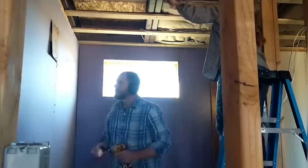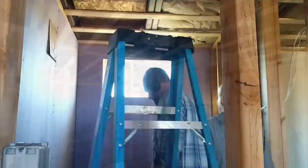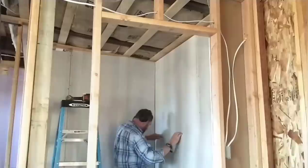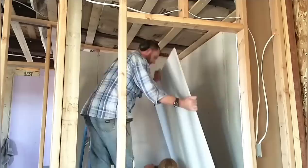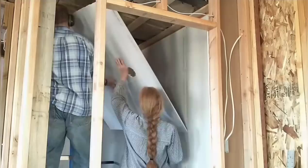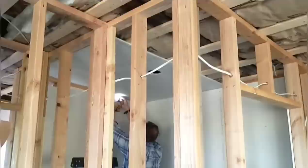While April works on insulation, I'm hanging drywall. The bathroom gets purple drywall — mold and mildew resistant, recommended for bathroom use. Here's some footage of us working on the pantry right next to the bathroom. We didn't have our overhead drywall lift yet — it had been ordered but hadn't arrived. The overhead piece was always challenging: put it up once, didn't fit, had to take it back down and cut it. Put it up again and realized I hadn't cut the hole for the light socket. Took it back down, remeasured, cut the hole. The joys of sheetrock! But with April's help holding it, we finally got the screws in.